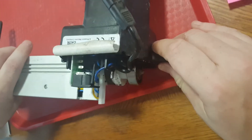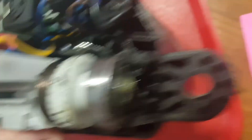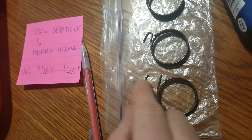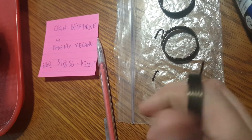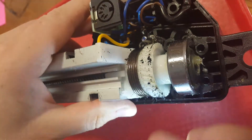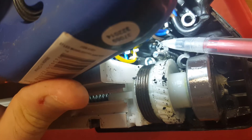Flip this up and here's what's actually going on inside. There's a spring right here — what happens is it's curled around like this, but see this hook? Over time it breaks away. This piece ends up getting stuck in a hole, and the other piece is still wrapped to the screw part. So when you turn the motor this part spins around and around, making that tick-tack-tack-tack noise. It's actually cutting into the plastic — all this black stuff is plastic that got shaved off every time the spring hit it. And right there you can see the piece of that spring that's broken off.